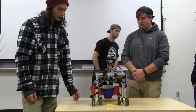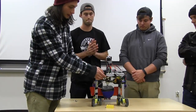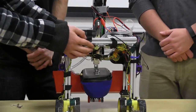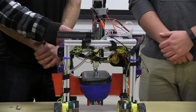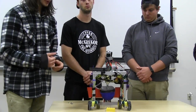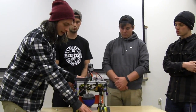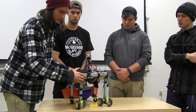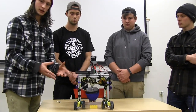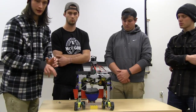It kind of forms a solid around the object so that when the arm is retracted, it picks the object up. How the robot identifies and picks up objects is using an actual camera — the Raspberry Pi camera — plugged straight into the Raspberry Pi, and we're using a software library called OpenCV. Basically, what the robot does is it masks out the background and identifies where the object is, and it lines itself up so that the object is within a range where the gripper can grip it, and then it runs the arm sequence and goes down and picks it up.